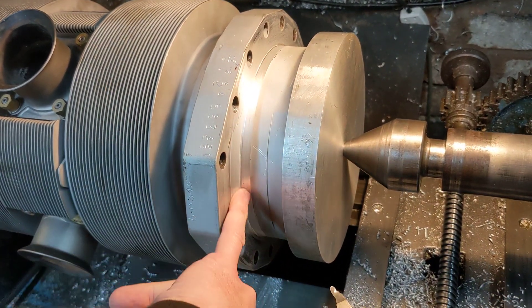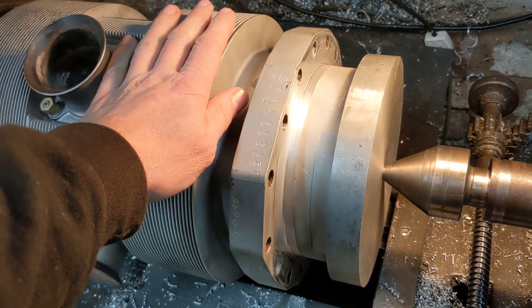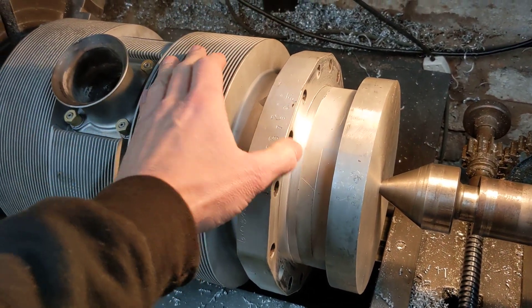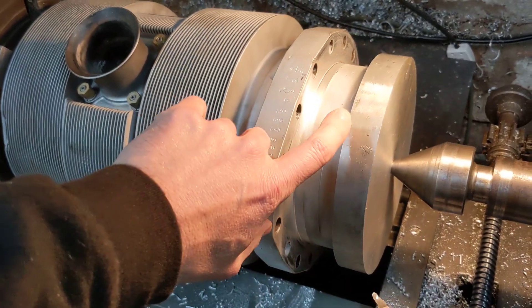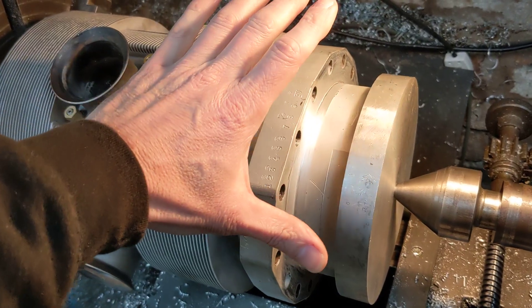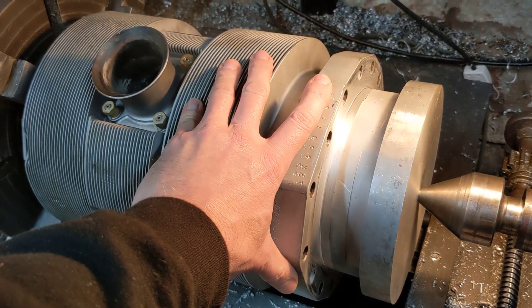On the engine that we plan to use, we've already machined off the spigot, but I want to put the dummy engine back together and I want it to be the exact same height overall as the engine we intend to use. So we're going to make a few 1/16th inch washers so we can bolt this onto the other set of engine cases.